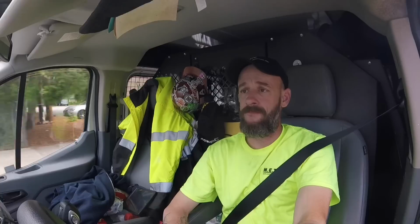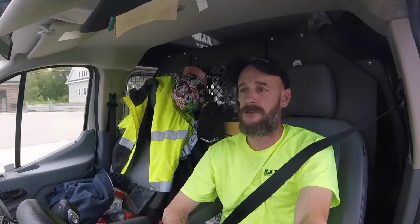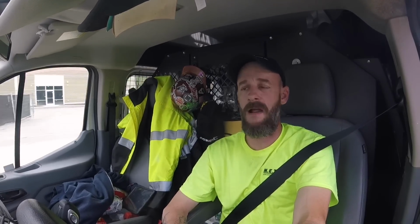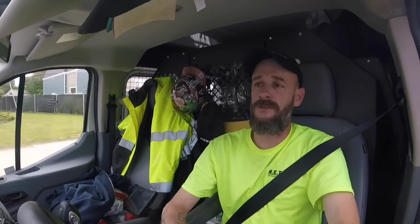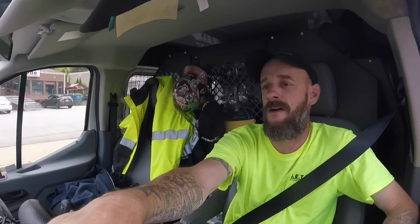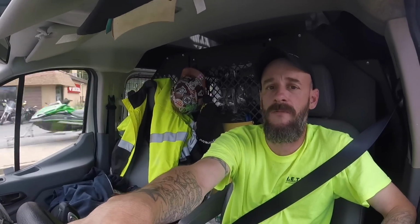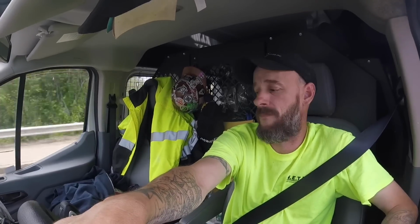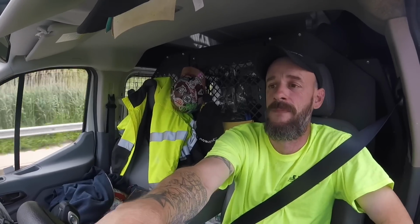But when it's real heavy like that, guys, I like to use a brush or a wire brush, you know, to get the real heavy stuff off. Always drop the pan too, because all that crap will just go in the pan and it'll just clog up your drain. So if you're able to do it, like I said, it's better to do it the way I did it. Drop the pan, take it off, let everything go on the floor, worry about cleaning it up after. A lot of walk-ins too got floor drains in them anyway if they got cement floors. So that always helps, but if not, you just clean it up with a big shop vac or whatever.